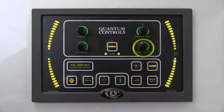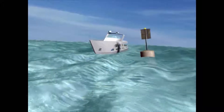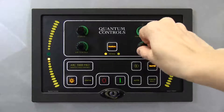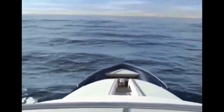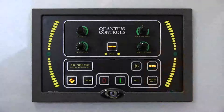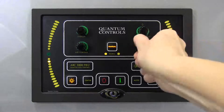The bottom right knob is the beam follow control, which allows a user to adjust the stabilizer actuator timing for changing sea conditions. When a vessel is in seas with a period of encounter close to the vessel's natural roll period, such as often occurs in beam seas, a heavier weighting of the roll velocity from the roll sensor will yield better stabilizer performance. In these cases, turn the beam follow knob counter-clockwise towards beam. When the vessel is in seas with a period of encounter much longer than the vessel's natural roll period, typical in stern quartering or following seas, a heavier weighting of the roll angle will yield better performance — turn the beam follow knob clockwise towards follow. Note that this knob must be adjusted by feel on board, and rarely is best performance achieved by turning it to either extreme.